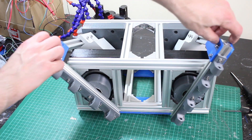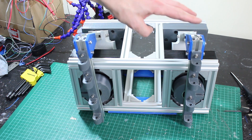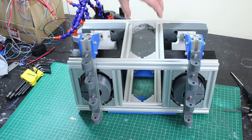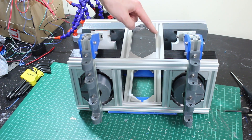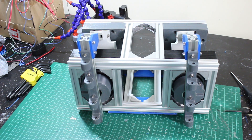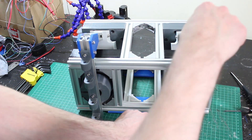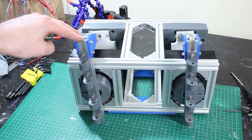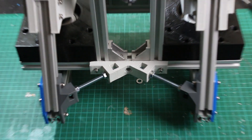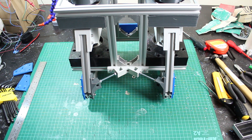Here's the bottom view with it all together — the legs can bend all around, more than enough for turning on the spot. They'll eventually be on an actuator — likely a linear lead screw that pushes and pulls them together on a V shape. In the short term I'm going to lock them in place with cross bracing so they're rigid, and we can fit the motor for that axis later. I've put a temporary piece in that locks this together and stops the legs rotating until I need to make them rotate. It's incredibly rigid.